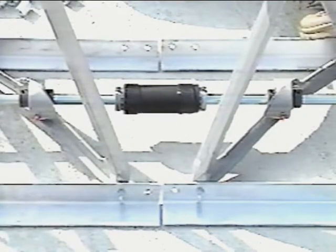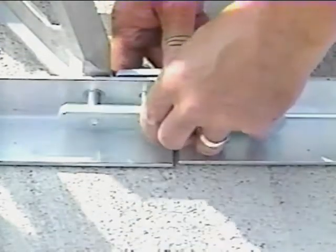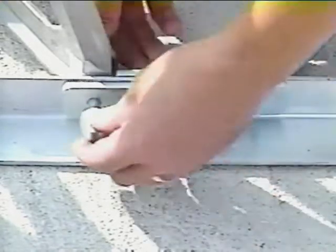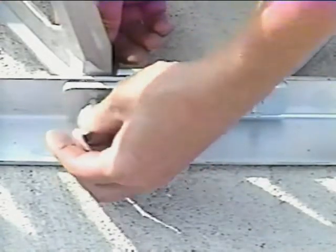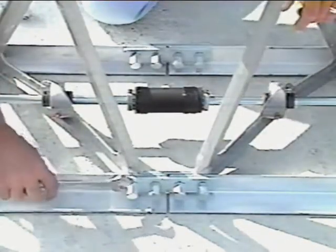Step 2. Make certain that the bottoms of the 4 blades at the juncture of any 2 sections are all in the same plane or level. Attach and tighten splice plates with blind nuts at the rear of the screed. Again, it is critical that the blades are all in the same plane. Tighten the splice plates hard. You will not be coming back to retighten them.